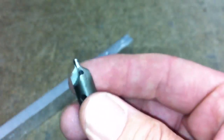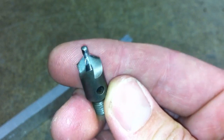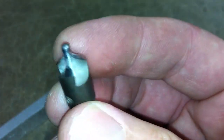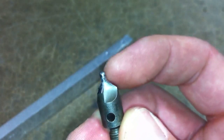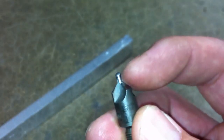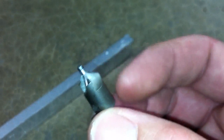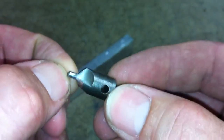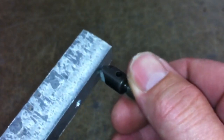The other type of countersink cutter is the 3-flute that you see in most places. It's the commonly used aircraft aluminum countersink cutter and it is cutting on all three edges. If placed into a cone, all three edges would be touching the cone at the same time. So what's happening is unless you put enough pressure on these, it's kind of bouncing around and choosing which flute to cut on. What you end up doing is pressing very hard into the material to get it to cut — otherwise it's bouncing around on those three flutes.